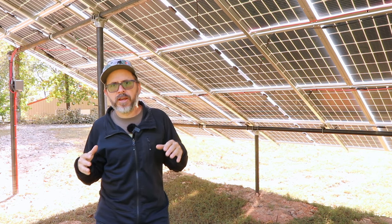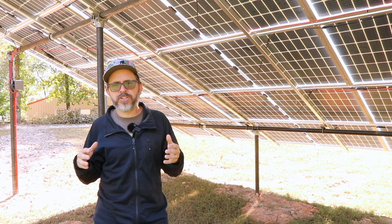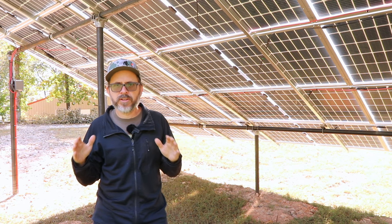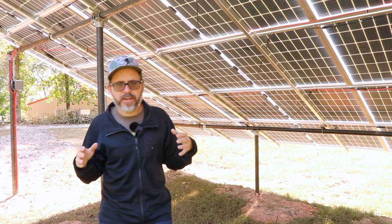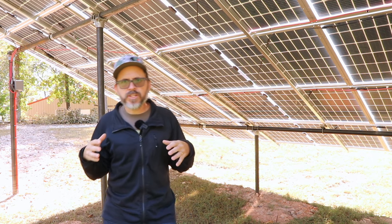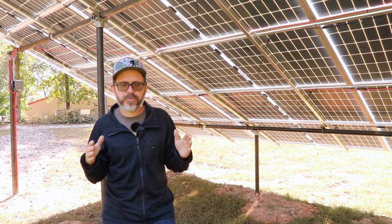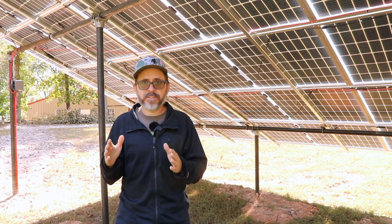And this is the big question. And this is why it's good to go to a solar installer. We used Abundant Energy of Arkansas, and Steve is the owner and full of so much knowledge. He's a great person to work with, super smart guy. But he will tell you, and any good solar installer will tell you, that you don't just say, I need 35 panels and this much battery. If you're on the grid now and you know your energy usage, look at your historic energy usage. So look at your energy bills. They'll have your kilowatt hours and your usage. And that is how you size your system.